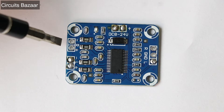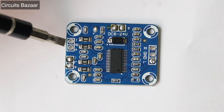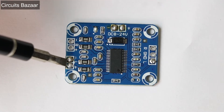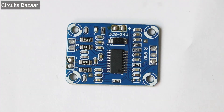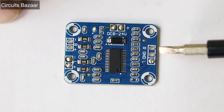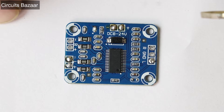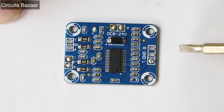If I talk about the pins, these are two pins over here which you can use to attach the speaker — this is speaker one and speaker two, or you can say this is the left speaker (L is written here) and this is the right speaker. Now if I talk about the signal, you can apply the signal either on the L pin or the R pin from the ISD1820 module, or you can also apply an aux signal here as well.